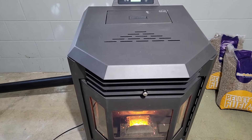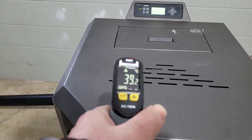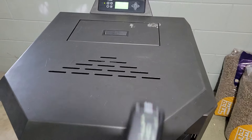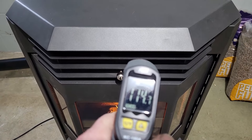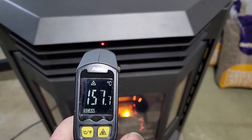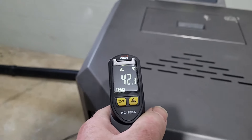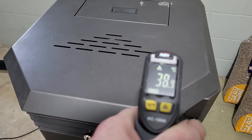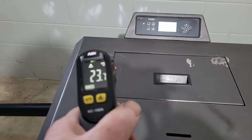The really good thing about these pellet heaters is what we see on the top here — you're looking at about 38 to 39 degrees. So even though it's over 100 to 130 degrees at the grills and 160 at the heat exchanger, the actual top of the machine is only around 49 degrees at the front, dropping to about 39 degrees further back where there's no heat.